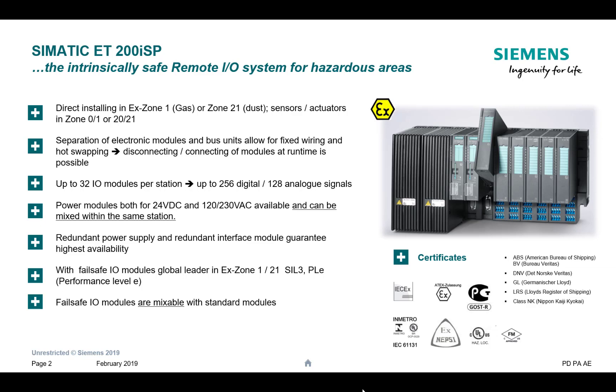You can see here: 256 digital and 128 analog. We still have the Profibus DP bottleneck on the ET200 module itself where we're limited to roughly 250 bytes, so you have to be careful with that. If you start bringing back the HART signals, don't forget you get five bytes for every HART value, plus two bytes for your analog signal — so seven bytes in total.